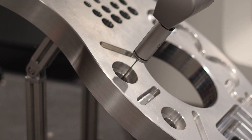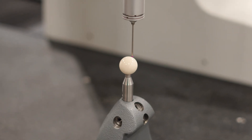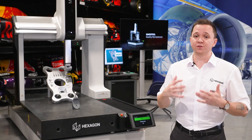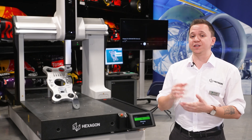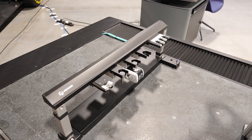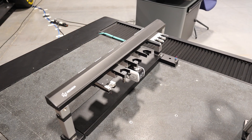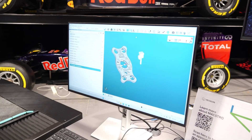You can also see our infinite B-axis movement. It used to be plus or minus 100 degrees and you had to wait until it stopped. Now we have a 5-axis positional axis, meaning you don't have to wait while you rotate your index. We also shortened our probe calibration process — now with just eight angles you can calibrate it and then use incremental angles, which means a faster process again.